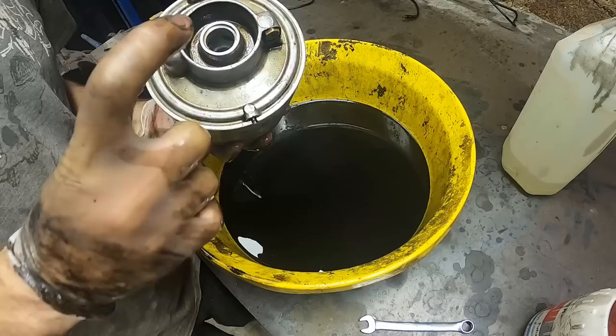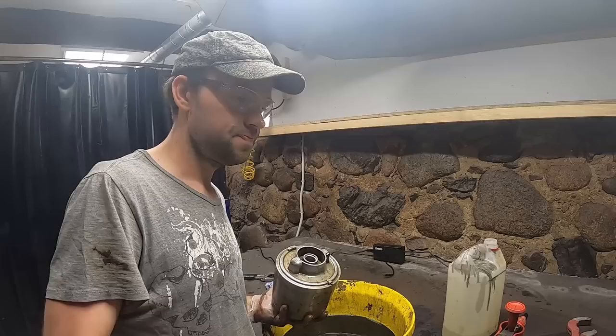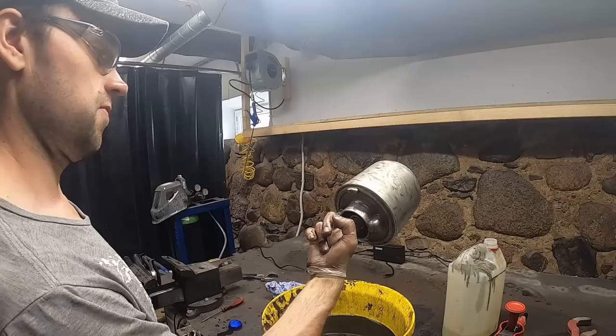I would like to get in there and thoroughly clean the wall as well. It did wonders on my Soviet tractor. After doing a thorough cleanup, the oil pressure just went from 1.8 all the way up to 2.7. Cleaning the filter housing did wonders on that machine. Sadly, I can't get it open.